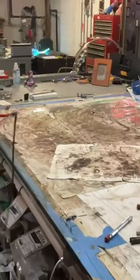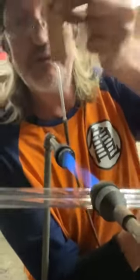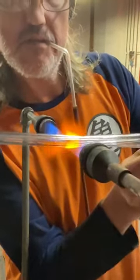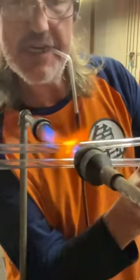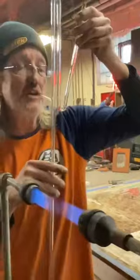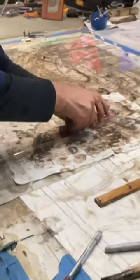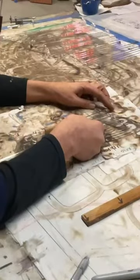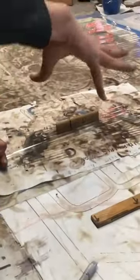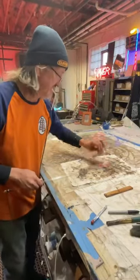I already got this marked. I have two different little spacers that I use. After I get this all hot, I'm going to do most of this bend right in the fire — put it in the face, blow, use your spacer, then pull it back out a little bit. It's a trick I had to learn. I'm about to heat up a bend right next to this bend. You think you're doing something wrong, but you're not — as it cools it goes right back to where it was originally. It's a mind game.